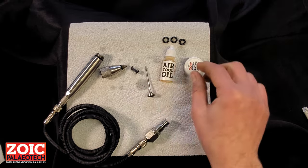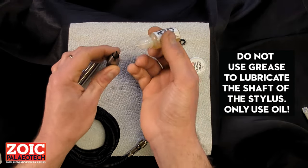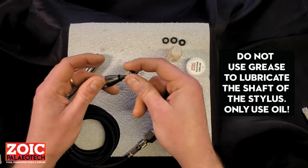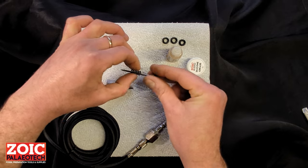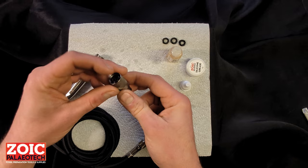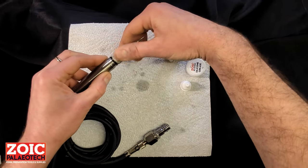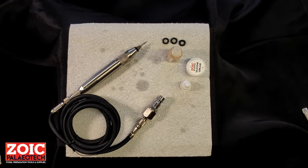Make sure the stylus is clean. Take a couple of drops of air tool oil and put them into the bushing. Run the stylus through, checking that the movement is nice and loose. Put the spring back on, insert it into the head — making sure the pusher plate sits below the top level of the head — then screw it back on, plug the pen in and run it.